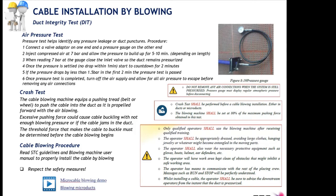Even if the duct size and cable diameter are the same, the section length and bends may significantly change the pushing force that creates buckling. You push the duct with the blowing machine as if blowing the cable, but set the pushing force to a very high value, purposely causing cable buckling. When the cable gets jammed, that is the extreme pushing force you must never reach. Then reduce the value to 80% of that force and you have the exact force needed for a smooth blowing installation.